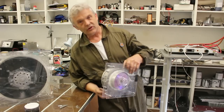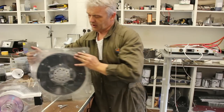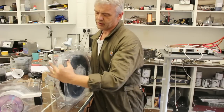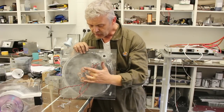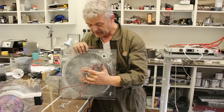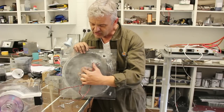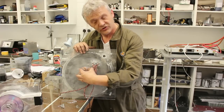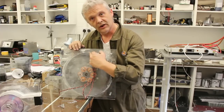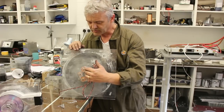We put that together because we had these bits and pieces. Now, this is the bigger one, and if I show you the back, we have a set of six coils here. These coils are wired up in pairs, so we have a set of three pairs where we get a north and a south. You can see the magnets are actually directly under these irons here — they're much closer to the centre and the discs are much larger. So it's much easier for those discs to turn past those magnets, and we get a more efficient machine this way.